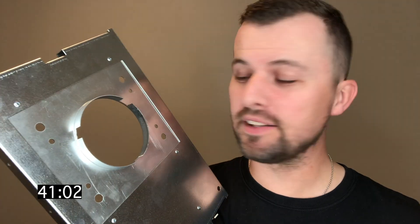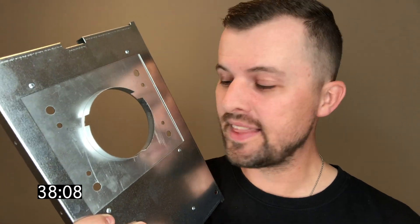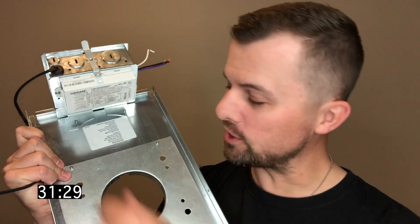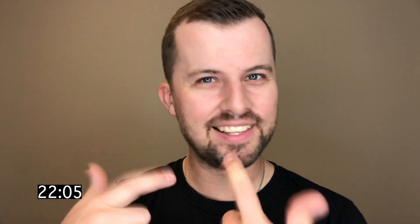Looking at the bottom panel of the frame, you'll notice this holds a variety of different shapes and different sizes. That allows us to pre-make these and get them out to your job site as soon as possible. Insurance — how does it work with the new construction frame? Your blocking supports on your trimless fixtures will be located on the backside. So tomorrow, if you need it trimmed, no problem. It's the same frame. Just simply ignore the blocking supports on the backside of that frame and concentrate on getting you trim assemblies, because now that frame can close up the ceiling and the job can continue.